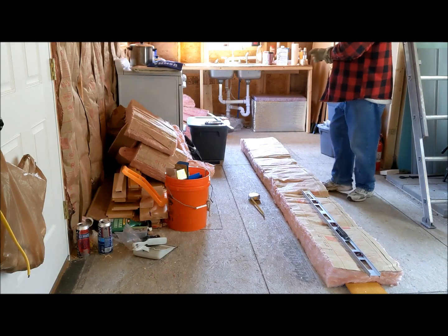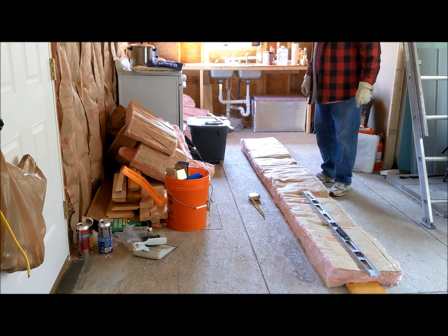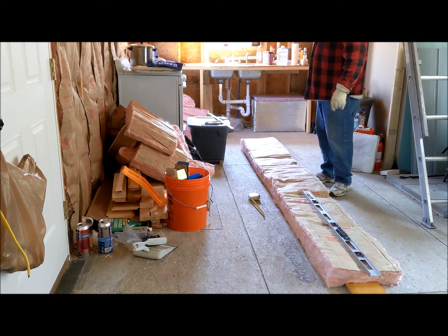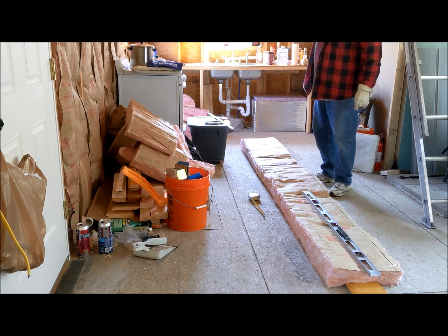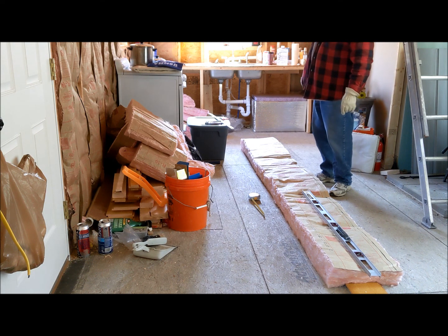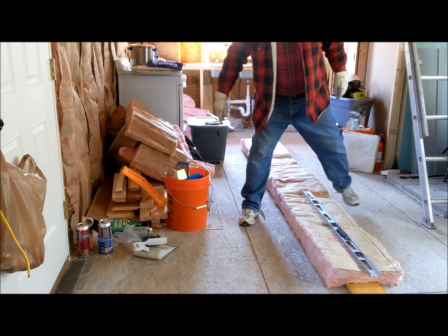I'm cutting fiberglass to fit into the odd openings in the wall, like on either side of the window there that are not 16 inches on center exactly. So I just cut this to length, which is 10 feet. That's how high the walls are. I've got 7.5 feet here, and then a 2-foot knee wall on top to give me more room in the loft. So it works out to 10 feet plus the loft joist here. So now I have to trim this to 8 inches wide.